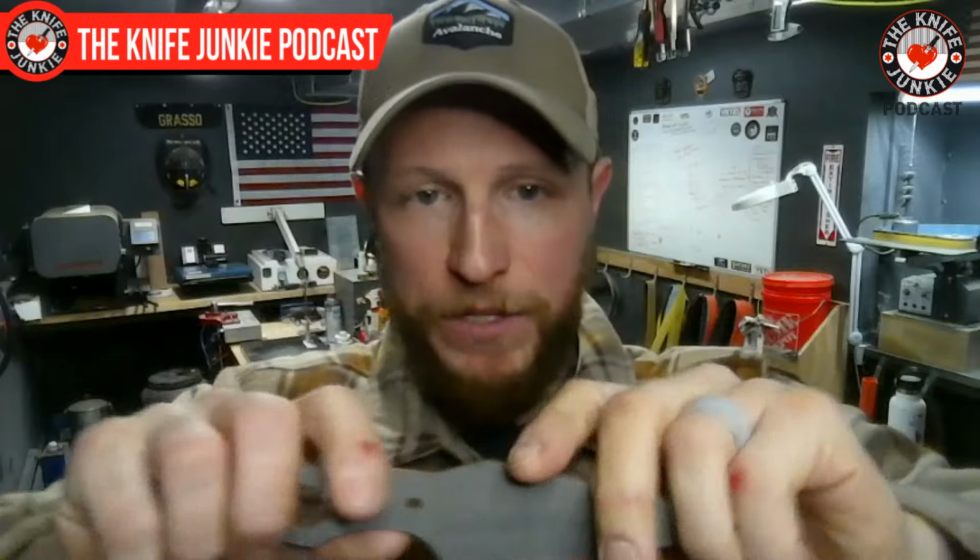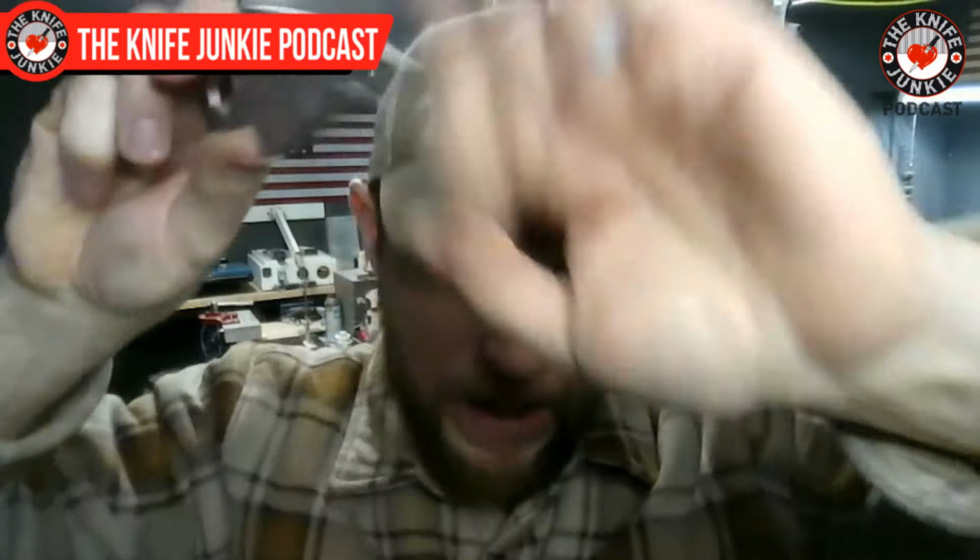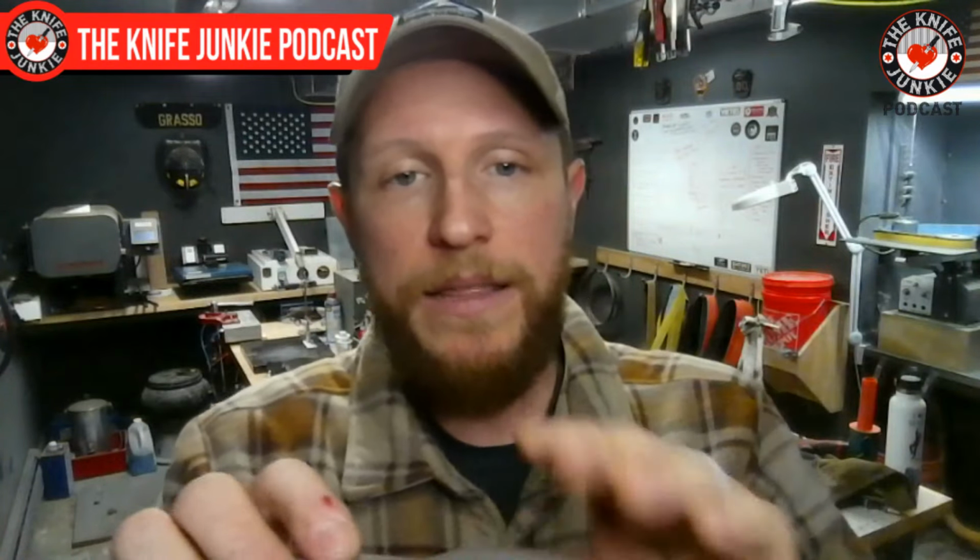And so there's some companies that don't grind that away, and they kind of leave it, and you can see it's kind of rough, it's not that pretty. Some companies leave that, but that wasn't acceptable for us. So I decided that on all our knives, we're going to grind that square. You have to take this knife blank, come over to the grinder and grind the entire profile square. That takes a little time.